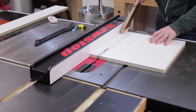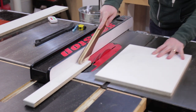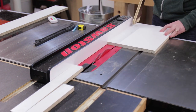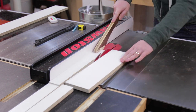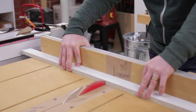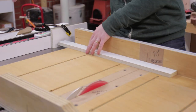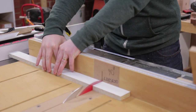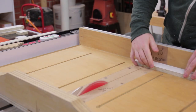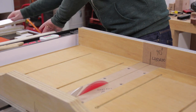The construction for this isn't really any different from what you've seen so far, just squish dimensions. You might wonder why I'm using a crosscut sled instead of the miter saw for these tasks, given I've just completed the miter saw fence. When it comes to repetition, in this case there are 10 of each part, the table saw is generally quicker for small parts that easily fit on the sled. With the miter saw you have to let the blade come to a stop after each cut.